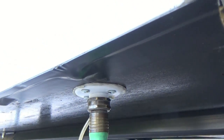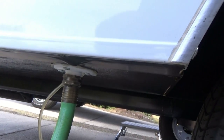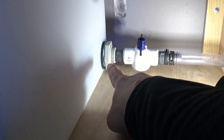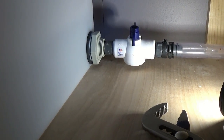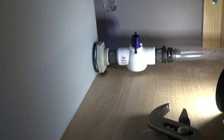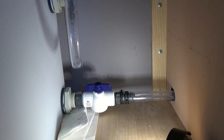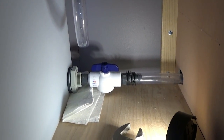I don't see any leaks around the edge, that's probably a good thing. Second attempt - I tightened this fitting up a lot more, probably didn't have it tight enough. We still have a leak, so I'm probably going to have to disassemble this fitting and do something for the inside - put another gasket or something to keep it from leaking. I'll disconnect this line and that line, pull the tank out, work on that fitting, make sure it's nicely sealed, and then we'll do a third test.